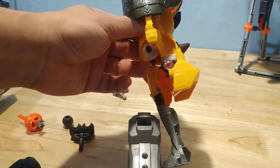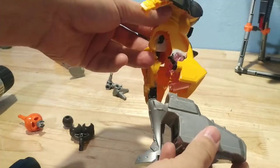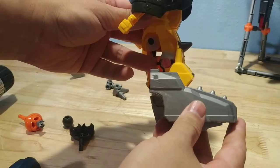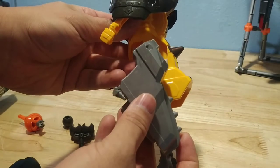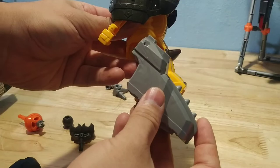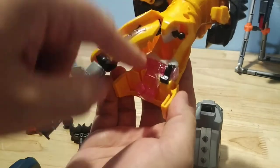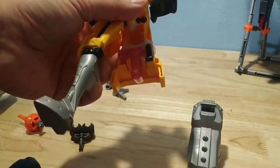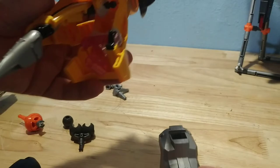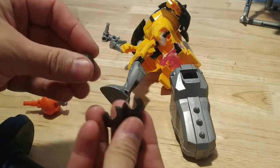Hopefully having a double ball joint will enable — let's just rip her leg off here so we've got a better view. The foot defaults to this position, about here. I want to use those two ball joints to move this way and then collapse so that it's filling up the entire skirt. I'm going to have to trim out all this extra plastic and this original joint that's currently taking up her skirt space. When in doubt, my strategy is usually to use two ball joints, and I'm going to use this socket for the other joint.